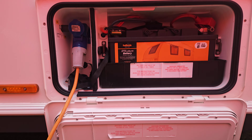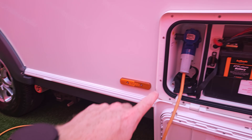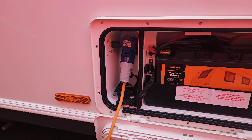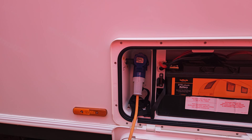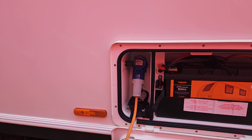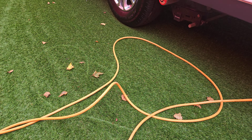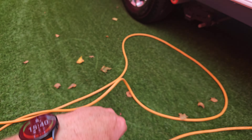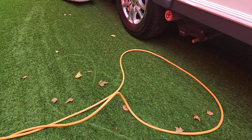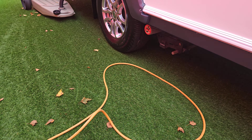If we're on a mains hookup site, you'll need a mains hookup lead like this one, which plugs into the side of the van and into the post on site, providing 240-volt domestic power. If you've got a mains lead on a big reel, I'd suggest unwinding it so it's nice and free-flowing. A coil can get very hot, draws quite a bit of current, and can end up melting the cable — so just bear that in mind.